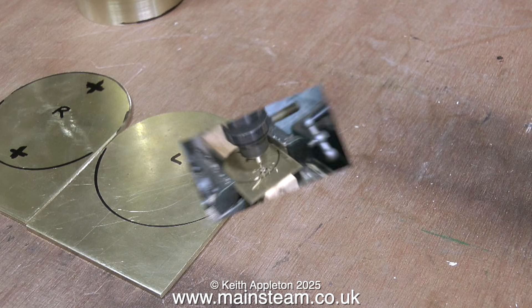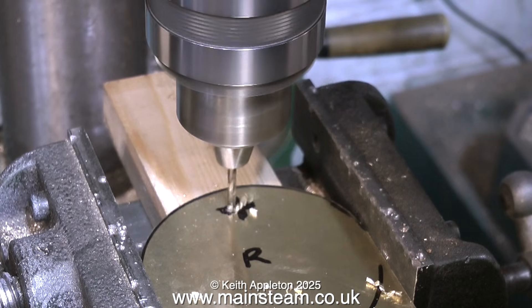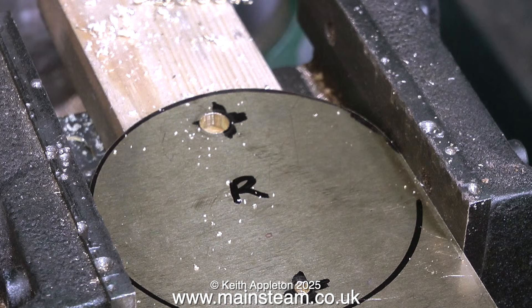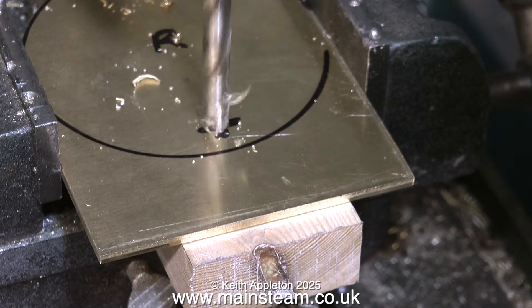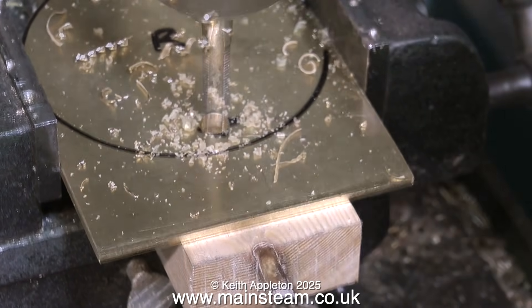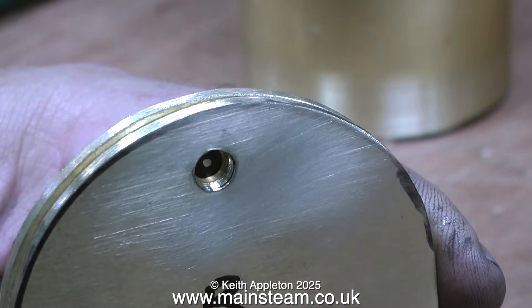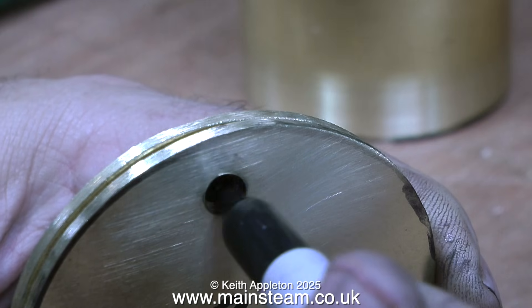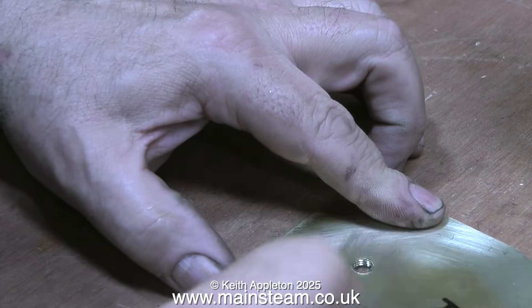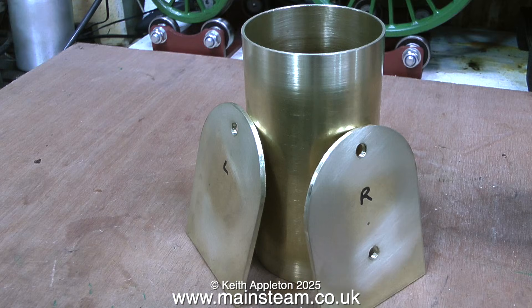Before soldering, I need to drill and tap some holes in these plates. The first felt tip pen mark was in the center, but I couldn't get the center on the curved part, so I moved the drilling machine's cross vice until the drill was in line at the other end — giving me two holes in the brass plate. I drilled pilot holes with a 3/16 drill, then drilled them out to tapping size for 5/16 by 32 threads per inch. The tapping size for 5/16 by 32 ME thread is 9/32 of an inch, which is two drill sizes down from 5/16 — generally fine for ME type threads. ME stands for model engineering.